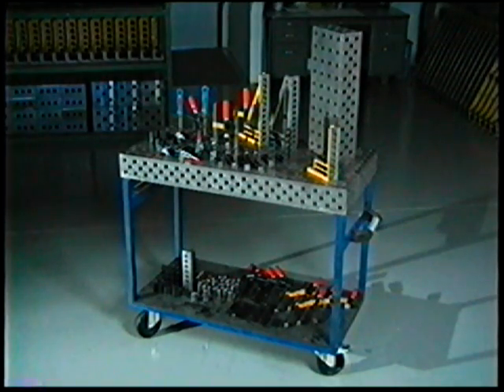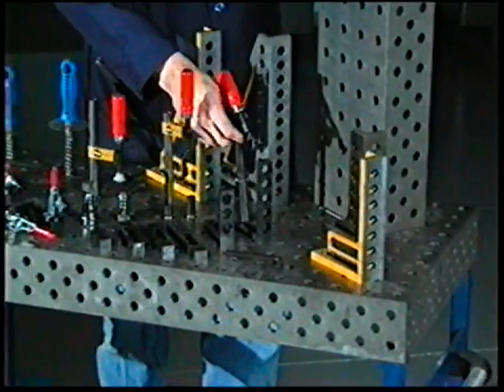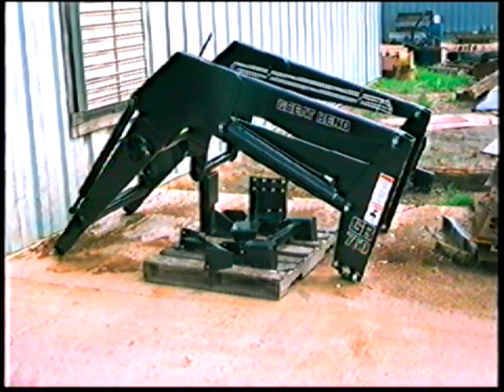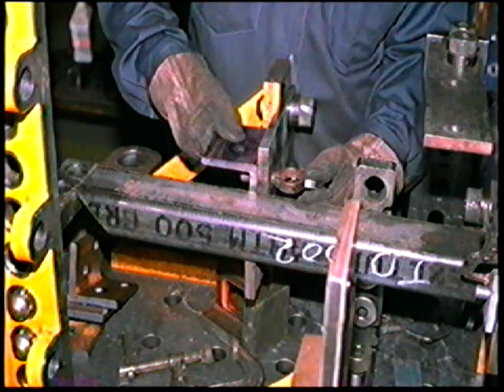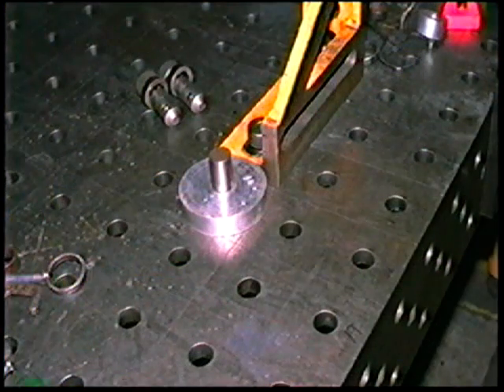The elements of the D16 system, while smaller in size, provide the same features and benefits as the larger D28 system. This wide variety of modular fixturing components makes possible a wide variety of applications. Great Bend Manufacturing produces aftermarket lift arms for a large number of tractor types. Their Demmler systems are used to manufacture mounting brackets in short runs. They have combined standard Demmler hardware with a few special adapter plates to speed the changeover from one part to another, and have also made their own setup disk to quickly locate the system components.